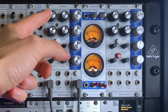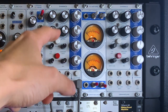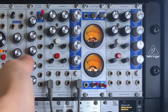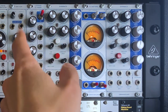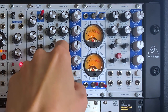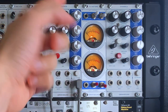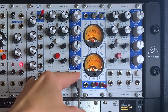The signal then goes through this amplifier drive circuit which, once you go above 12 o'clock, starts adding soft clipping distortion for nice overdrive effects. Then it goes into the meat of the unit — a single all-in-one compressor-expander VCA-based circuit. Next it goes through a mix control which lets you blend between the processed and dry signal, really handy for parallel compression. Then through the sub bass enhancer which adds sub bass harmonics, with a boost control to add even more. The compressor-expander output is normalled to the EQ input, so it effectively runs straight into the EQ circuit.